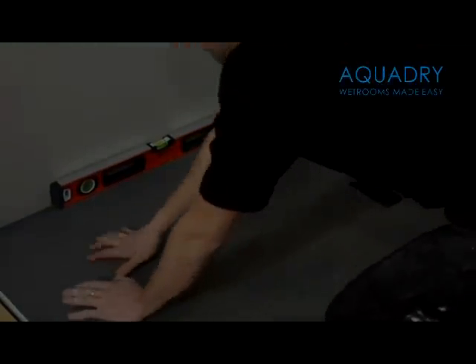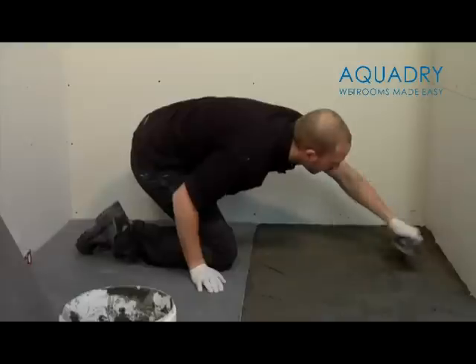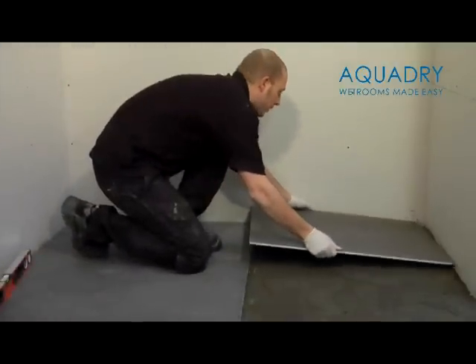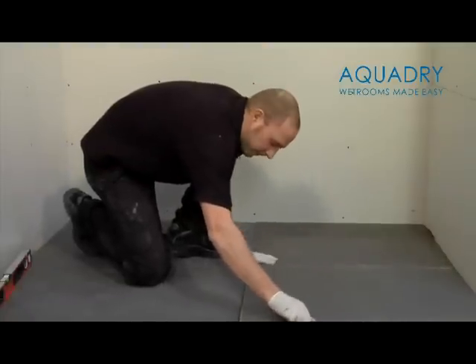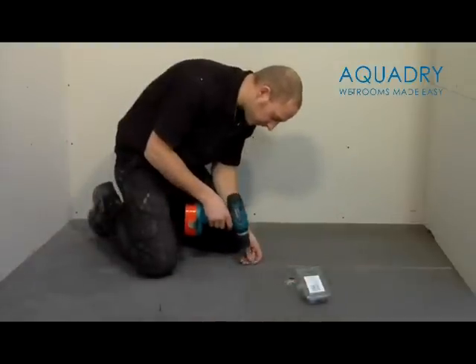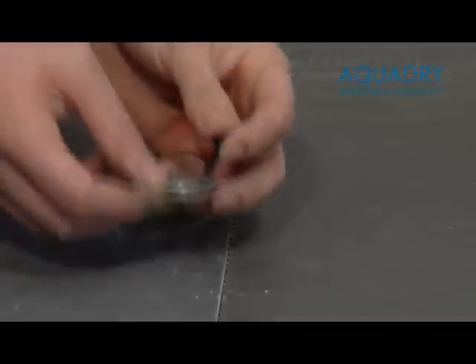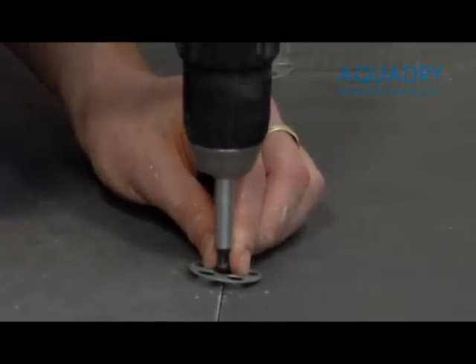You are now ready to overboard the rest of the wet room floor with your 10mm insulated boarding, which will bring it to the same level as the shower tray. First, mix the remainder of your fix KST adhesive and spread across the bathroom floor as you have done previously, with your notched adhesive trowel. The 10mm insulated boards can then be laid over the adhesive. It is good practice when bedding the 10mm board around the shower tray to slope it very slightly towards the drain, to avoid the chance of unwanted puddling in the wet room area. When the adhesive is dried, it is important to mechanically fix the boards with the washer fixings over all the joints at approximately 300mm centres. Please ensure that you use the washer fixings with no larger than 25mm screws, so that there is no chance of a screw penetrating the floor boards and potentially hitting wires or pipes beneath.